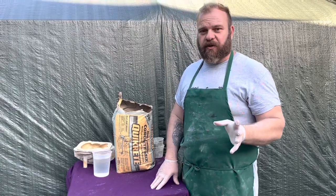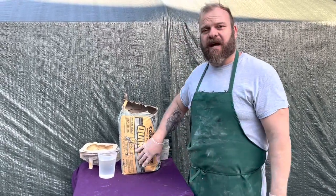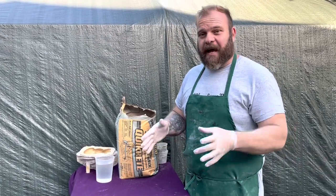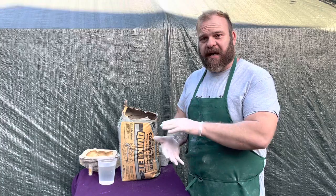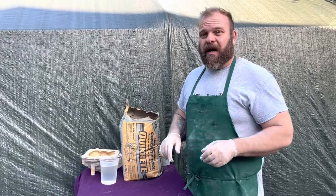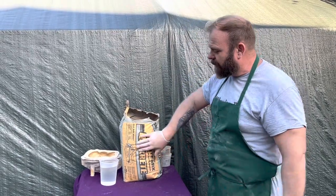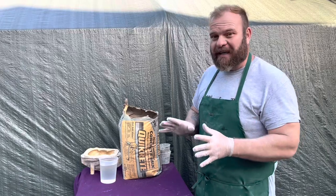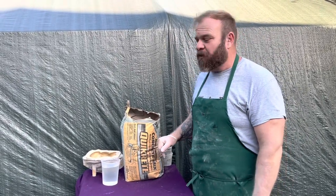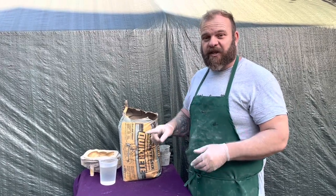Now if you've watched any of my old videos, you'll know that in the past I have not been a fan of these. I definitely prefer what I did in my last video when I actually have the separate gravel, cement, and sand, because then I can control the actual ratio perfectly — I know exactly what's going into the mix. The problem with all these pre-bagged mixes is you never know quite what you're going to get. Some of them have way more gravel than I normally would use. Some of them don't have near enough cement.